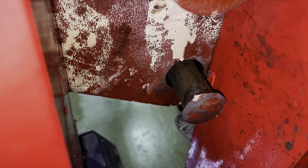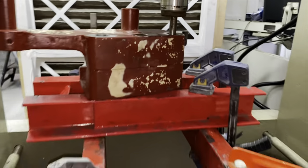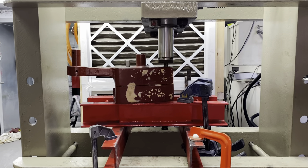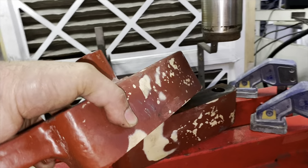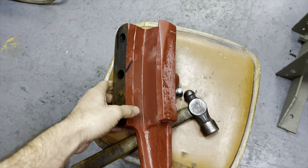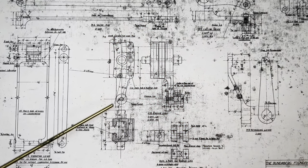When producing these videos, sometimes parts of the operation were filmed a long time ago — we actually pressed these pins out of the expansion links nearly two years ago now, during COVID. You can see there's filler on there to smooth out the rust surfaces on the primer, so things tend to jump around as I'm trying to tell a coherent narrative. Here they are split apart — they've probably never been apart since manufacturing in 1924. You can clearly see the ridge for the slideway where the die block would slide up and down.